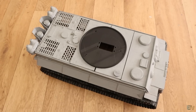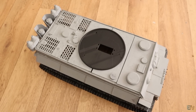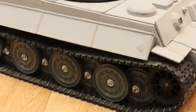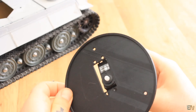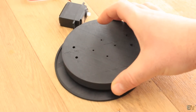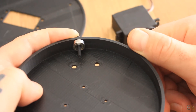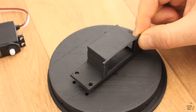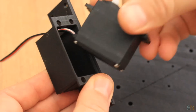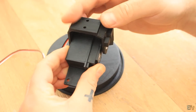You could also find all the parts for the 3D printed tank ready to download below this video, and you could also see the video where I build this Tiger 1 piece by piece. On this base I will fit the first servo and on top of this I will add this rotating plate. It will have some bearings on the side so it will rotate without wobbling. On top of this I will place this other support for the second servo, and after we insert this servo inside of this part, we can add the turret arm that will move up and down.